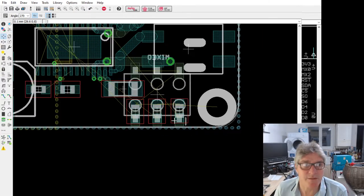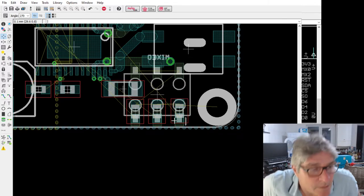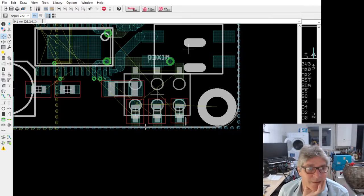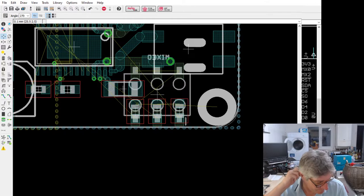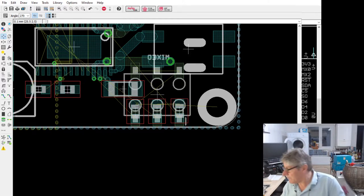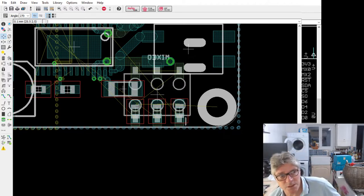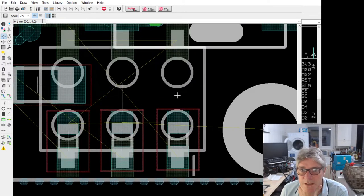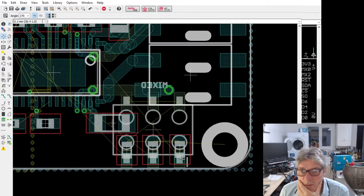Those are the input filter capacitors for the end stop. We have a pull up 10K and then a pull down 0.1 microfarad. Basically acts as a low pass filter coming in. That's good for end stop, but if we were doing quadrature encoding, that might not be so good. But we haven't really got enough pins to do quadrature encoding for each of the drives anyhow, so it's probably pointless trying to support that. Just leave this as it is, that will work roughly.